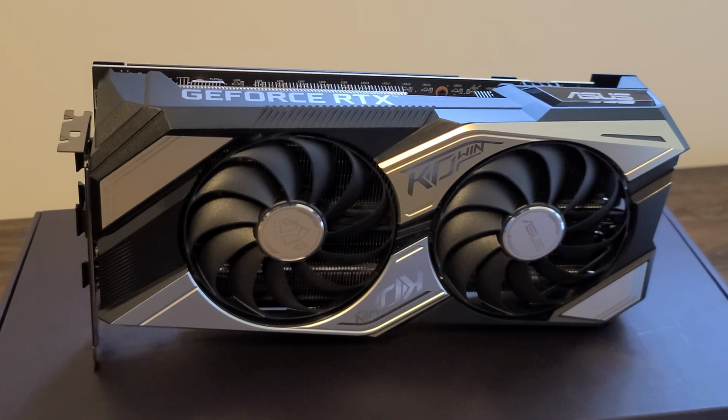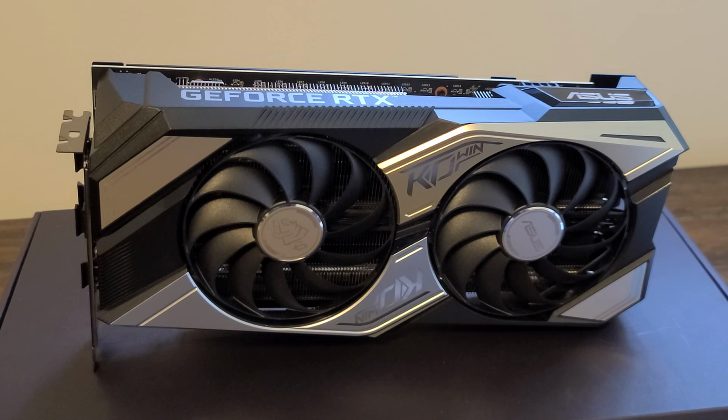It's funny, I actually found some sites that were saying it was GDDR6X, which according to the ASUS manufacturer site, it is just GDDR6. I looked at the B&H Photo website, which is a site that sells electronics, and they claimed it was 6X on their site. So there's some confusion apparently from some retailers. But that's 8 gigs of standard GDDR6 on a 256-bit memory interface.